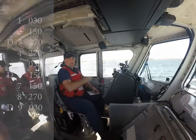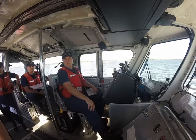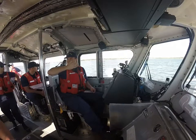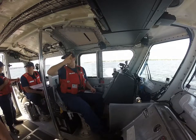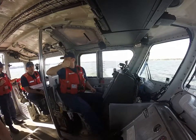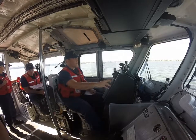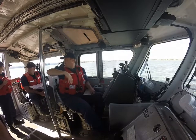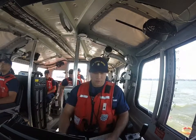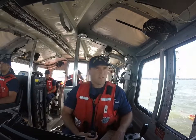We've got the courses, we're on scene, everyone's got their jobs. Go ahead and engage your engines — stand by datum. I want you to pivot and put your bow to a zero three zero. I'm going to pivot the bow in the direction I want to go first, then throw datum before I start going. We want about six knots but we're going to use our RPMs. Once you steady up on zero three zero, come up to eight hundred and fifty RPMs — set it and forget it. Maintain the same RPMs throughout this whole evolution. I'm going to drop a waypoint and deploy datum. Come ahead to eight hundred and fifty RPMs, steer zero three zero. We're starting our legs — I'm going to time them with one-minute legs.